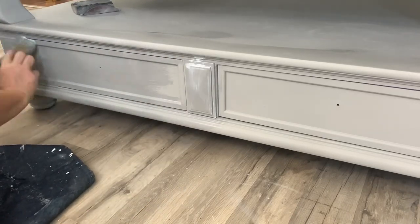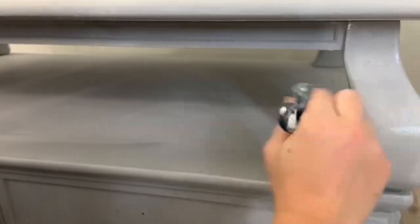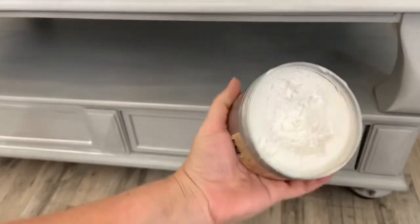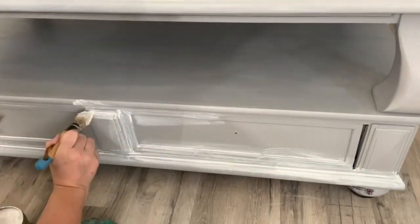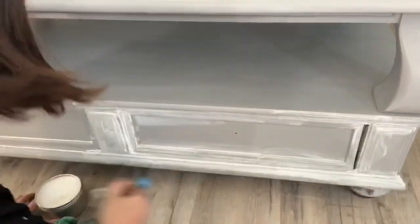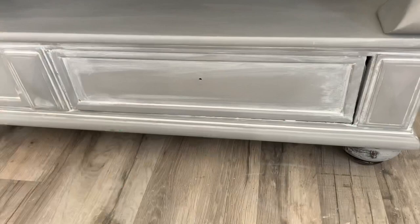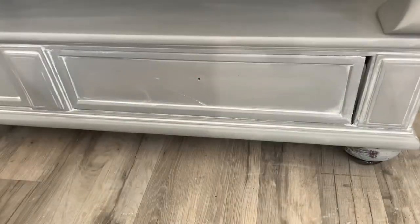I decided now that the bottom needs depth like the top has. So I use my water-based polyurethane and do one coat so that I can put some white wax on it. Here I'm using Dixie Belle's Best Dang Wax in white, using my Amazon brush to put it on — in all the crevices, everywhere that I think could use a little highlight. I let my sealer dry, applied the wax, and now I'm wiping it off with a damp rag. It's coming off with such ease because I used the sealer. I kind of feel like this 80s determination music was super appropriate for this video because I'm not feeling super great — I have a cold and I'm really trying to get this done. There are so many obstacles. I kind of feel like the Karate Kid, or maybe like I'm in a Jean-Claude Van Damme movie montage.